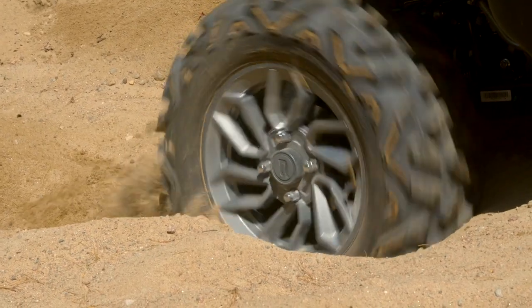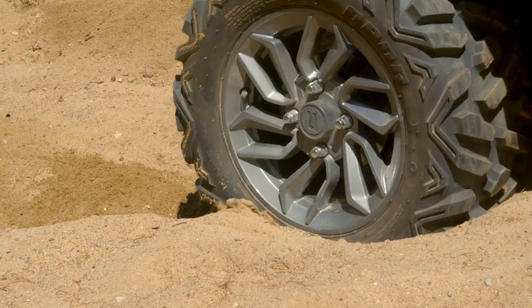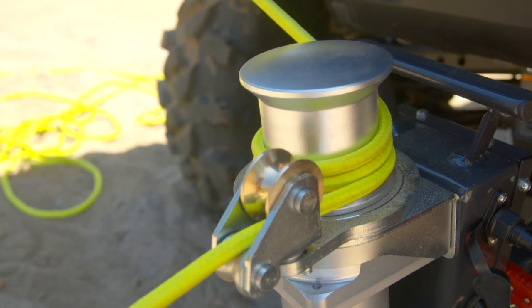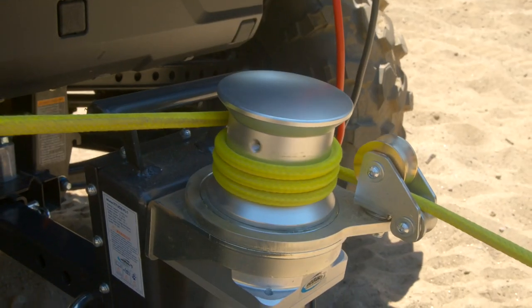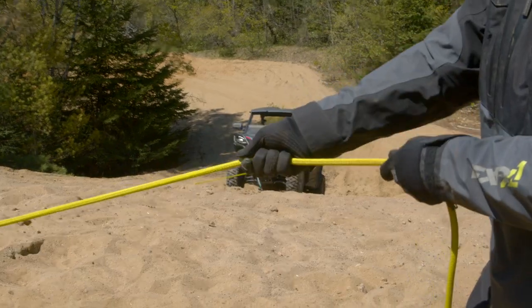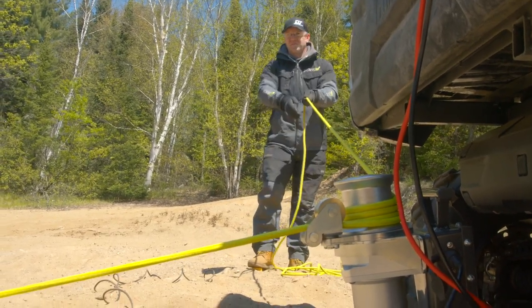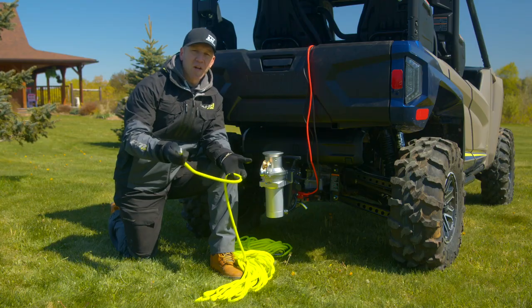You'll see winches like this in the marine industry for lifting anchor lines or hauling in big crab traps in the north Pacific, made popular by the Deadliest Catch TV show — so you know they're durable and strong. This Tugger 2 FL1 is no different, with a 121-to-1 gear ratio, a 2.2-horsepower motor, and a line speed of 55 feet per minute at a 200-pound capacity. This is a serious winch.